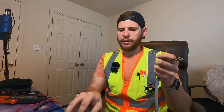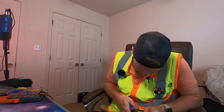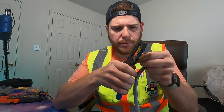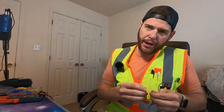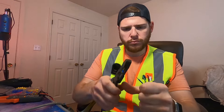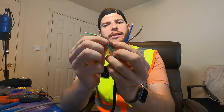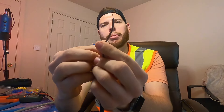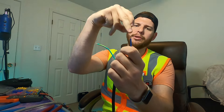We're going to take this cable here and butt splice it into these three cables. Let's pull out our box and use these red butt splices - should work fine. We've got these wire strippers here; we'll strip back a little bit of the cable and then strip back our power supply cable too, get it all hooked up and wired in. If you look up the color code for this power supply, green and yellow is your earth ground, blue is your neutral, and brown is your hot - that's pretty common with these three colors. Now we're going to take three butt splices and splice the power supply to the NEMA connector.